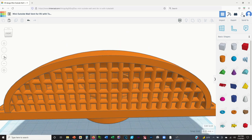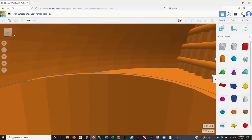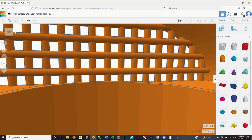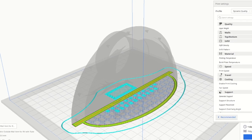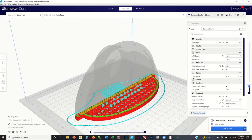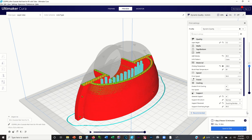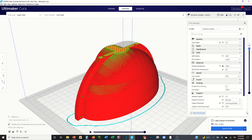The cool thing about Tinkercad is that you can view from different angles and zoom far enough to go inside — here's a view from inside the vent so we can see exactly what the object will look like from every possible dimension and angle. Once the product is done, we export the file into a program called Cura. Cura is a slicer program — it breaks the object down into tiny layers, in this case about two-tenths of a millimeter tall, and shows us what each slice will look like as it's printed on our 3D printer.